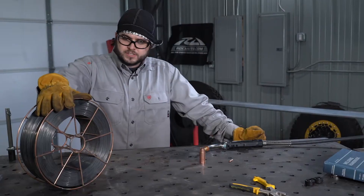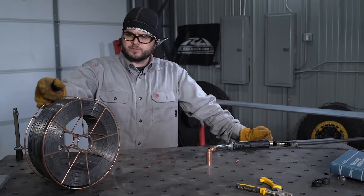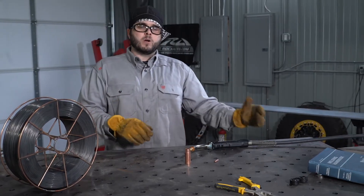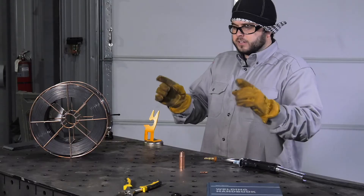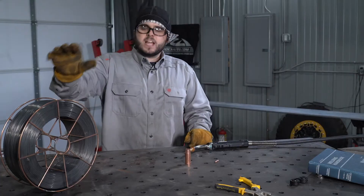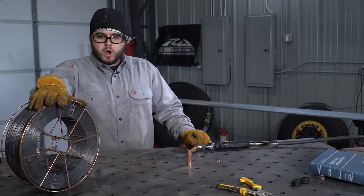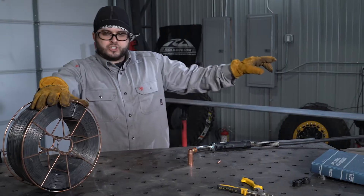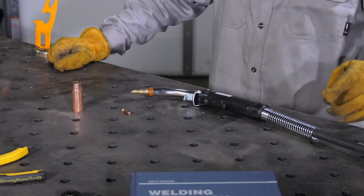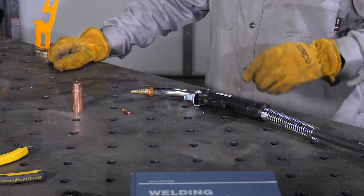What is flux core arc welding? Flux core arc welding consists of a tubular electrode that's filled with a granular flux. If you've seen our videos with the shielded metal arc welding process, we utilized an electrode with a flux on the outside — this is pretty much the exact opposite. This spool of wire is put in a machine and fed through to a gun. The business end of the flux core arc welding process is at the gun.